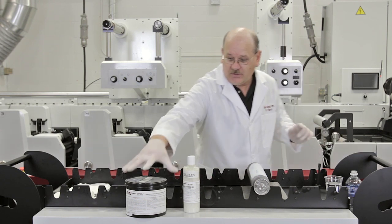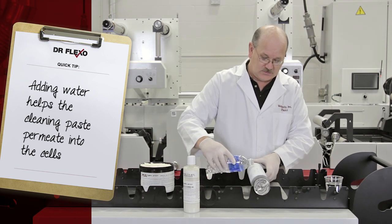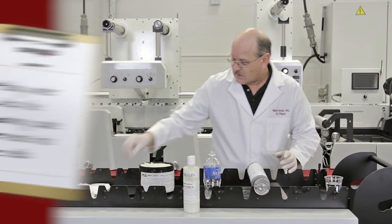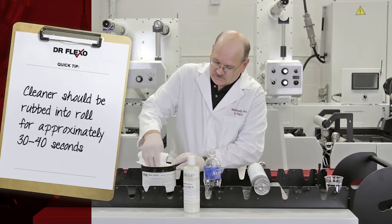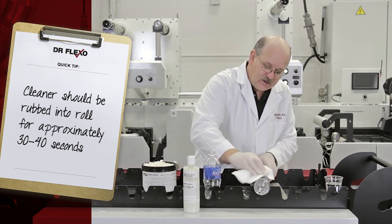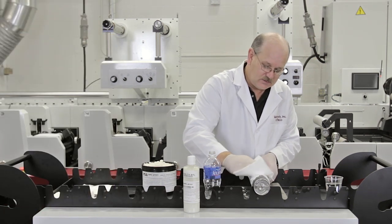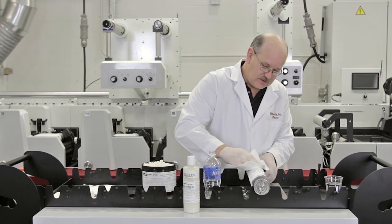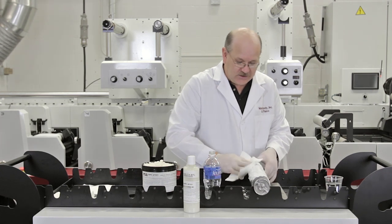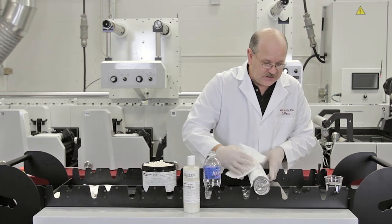What I want to do to begin with is add a little moisture to this roll — I'm just going to add some water. I'm going to take the cleaning paste and just liberally rub it into the anilox roll. Water is your friend here. You need to get this product wet, you need to get the ink wet, and you need to get it to permeate down into the cells.